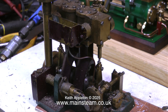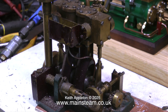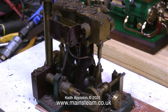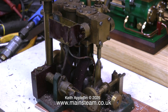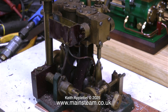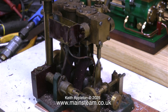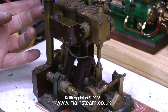Time to connect the airline and put some air pressure into it. For this first test run I'm making sure that every moving part has got some lubrication, and it really is running well. I'm not putting too much pressure into the engine — there's only about 15 to 20 psi going in — but it's quite powerful and it's timed well; I can't fault it in any way. I'm not over-revving the engine because I'm not sure what's happening inside it in the valve chests and the cylinders.